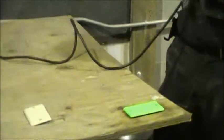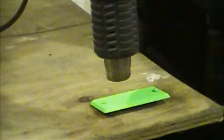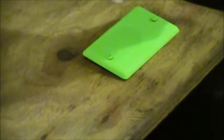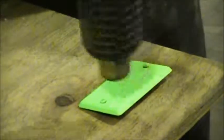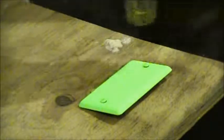While that's baking, let's flip around here and we'll go ahead and start curing with the heat gun. You can see the part's still wet because we've got lots of shine going on, and we've got to get rid of that — we've got to get that liquid moving out of there. Keep the heat gun moving guys. If not, you're going to wind up bringing it into gel state before it gets dehydrated, and that will cause bubbles and rings in the final coat.